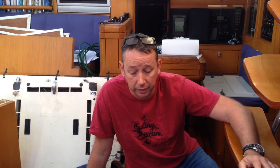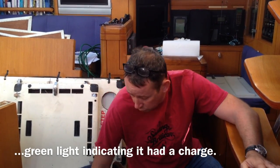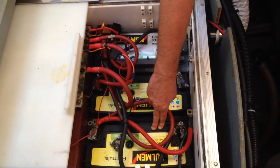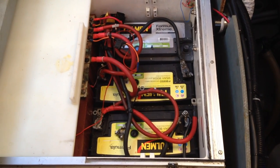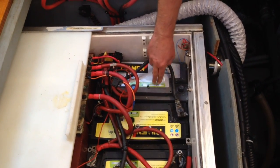As you can tell, we changed the starter motor and hey presto — it's still making the same noise. Someone told me we've got to check the battery. A friend of mine tested the cold cranking amps. This generator battery is rated at 1000 CCA, but when we tested it, it only showed 63 cold cranking amps — no wonder it couldn't turn the engine over.